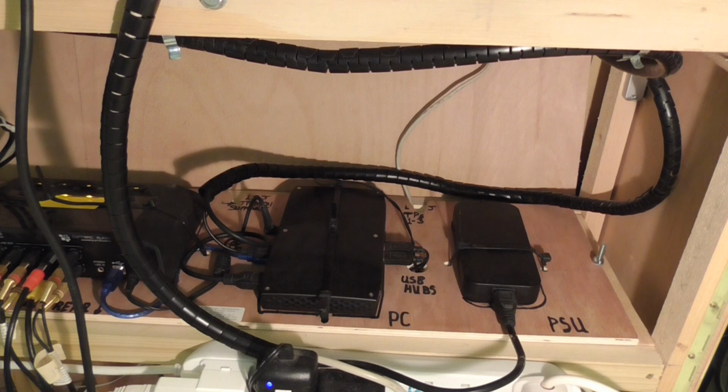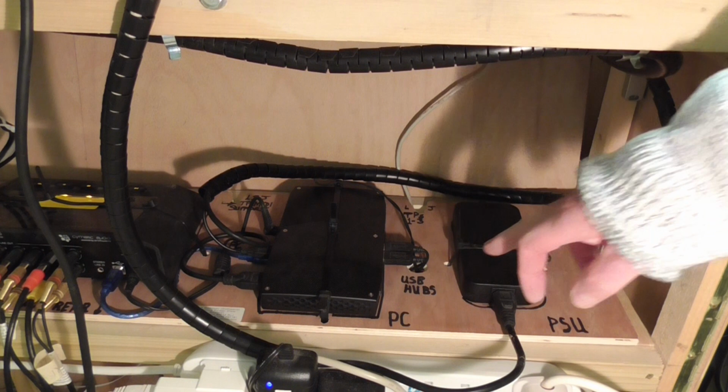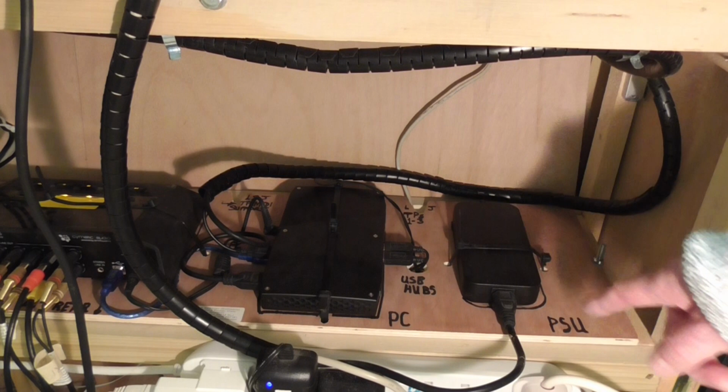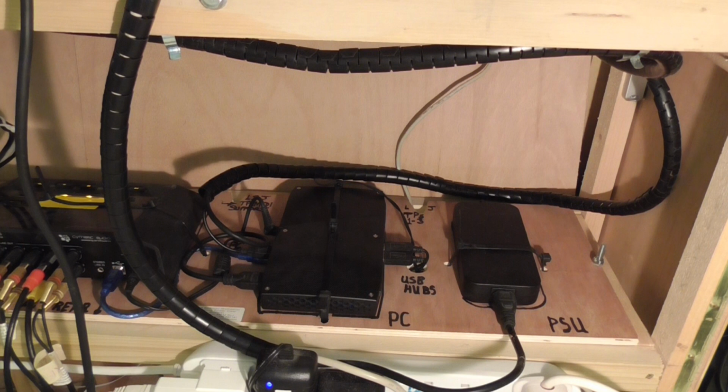This PC has got enough USB slots to provide the basics, but you will see that in my installation I've got so many USB devices, and you'll come up to those in a minute, that we actually have to have 2 USB powered hubs. So actually we have, you can see here, 2 USB connections there, and you can read that they are to USB hubs. And then we also have 2 more around the front here, and they're 3.1 USB devices, so they're fast, although actually USB 2 is quite adequate for most of this, even though Hauptwerk is very demanding.